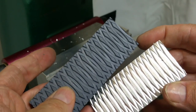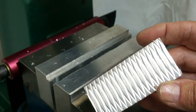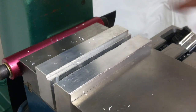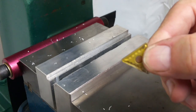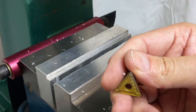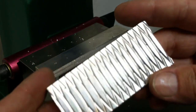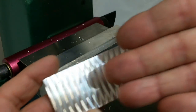Somewhat reminiscent of that pattern, but you can tell this is made with a smaller radius than this cut. A fly cutter — you can adjust the radius, so you can make whatever you want. The profile on this tool: it's a 60-degree included angle, but it's canted like seven degrees back, sweeping through for some rake. And it's also not normal to the surface as it's sweeping through — it's canted back and also canted out, so it's not a symmetrical pattern.